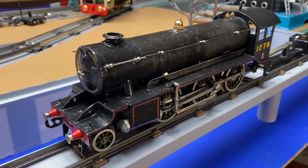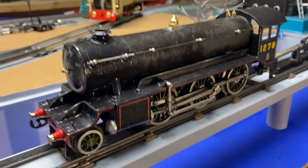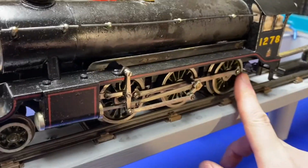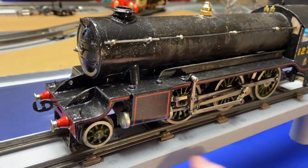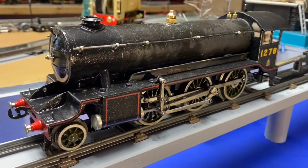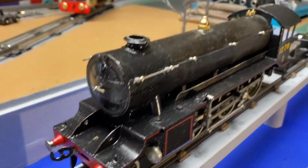As a real steam engine, of course, you have to oil it. Now, I just use light, regular machine oil or medium machine oil, and I routinely oil the various bearings and moving bits. That's smart, but of course you cannot use that as steam oil.